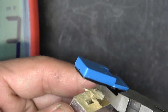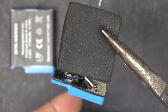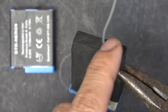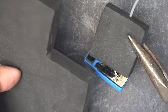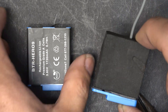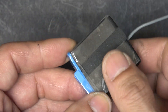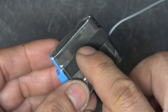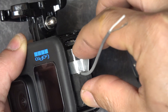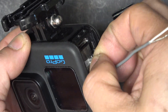Now we'll cut it away. Here is the BMS — I solder wire to the terminals, then take a piece of EVA foam, drill a hole, and thread the wire through the other side. This is 10mm EVA foam — people use it a lot for cosplay, but this is my cosplay now. It looks just like the original. I use double-sided tape to stick it on the plastic, then clear tape wrapped around to further secure the foam. Then I push it in just like that, and put a piece of duct tape on it so I can pull it out easily without pulling on the wire.